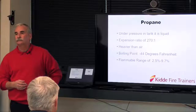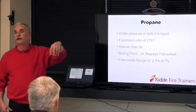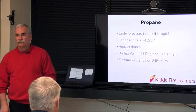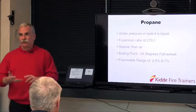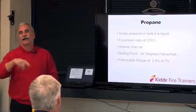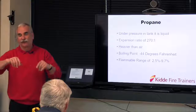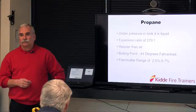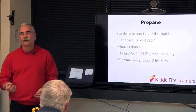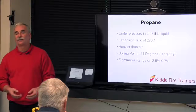Question about transporting: do you want to unhook the propane cylinders? No — the shut-off valves are right on the tank, that's where we're shut off. At the end of a training day, shut the tanks and leave the generator running — that's going to burn any gas out of the lines. When the generator shuts off, your lines are clear of propane. There's minimal propane held in the system itself — it's about 50 feet of one-inch pipe, and the generator takes a couple of minutes to burn the line out.